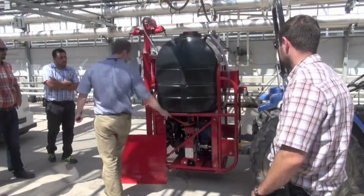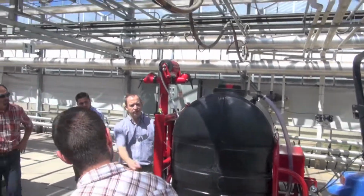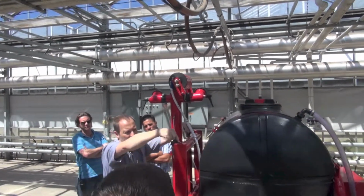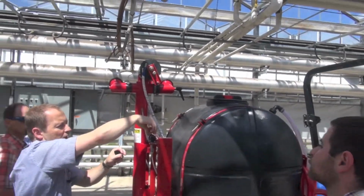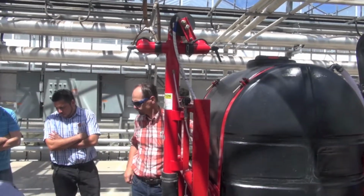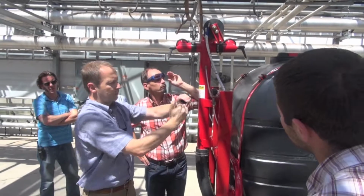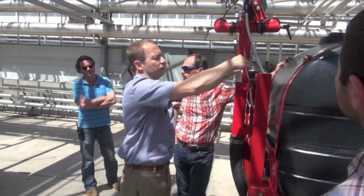Okay, so that pump is going to force solution up through the solenoid valves, up through these lines. You've got isolation valves on here, filters and a little check valve in here. And then these nozzles, these little pieces, these are actually the same thing we use on a pulse fog for restricting flow. Don't use the washer. So your solution is going to go through here and out. This hole is restricting the flow. This is what's governing your flow rate up to the nozzle.